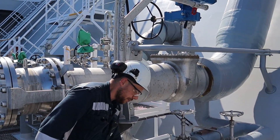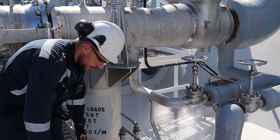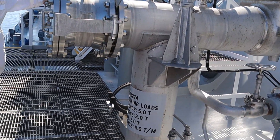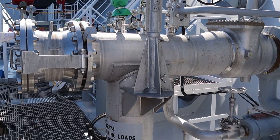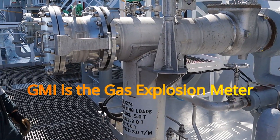After the third repetition, we check for liquid. We make a crack-open on the drain and see if any liquid comes out — which we don't want. We use the GMI to verify, and we do this at least three times in order to make the line liquid-free. After that, we measure with the GMI again for gas content.